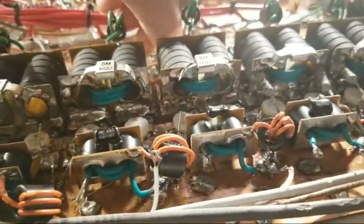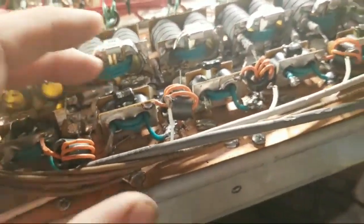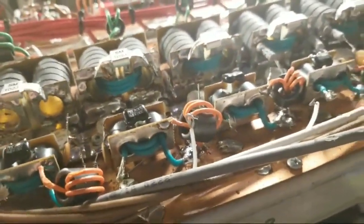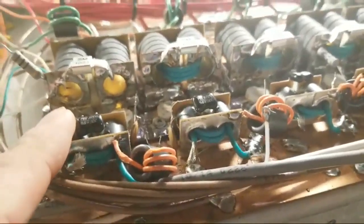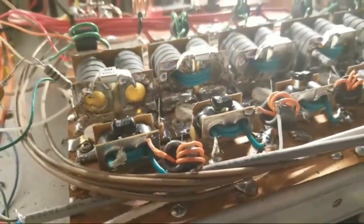I gotta retune the box, and I'm doing a three-and-three over here — three-and-three, as you can see — like it's supposed to be, not a two-and-three. Since X-Force started doing that, I talked to him about it — it works a lot better when you do a three-and-three. So when you wrap it for 2879s, if you're building the box, all you box builders should try three-and-three. When you get those boards from the RCI, they do a three-and-three as well — it makes a lot of difference. The modulation comes up and sounds a lot cleaner.